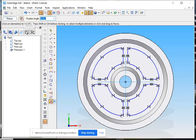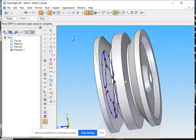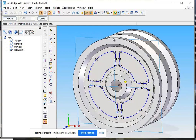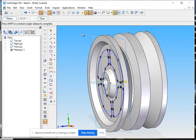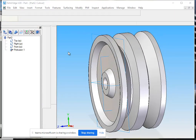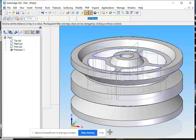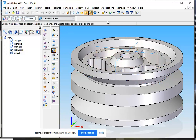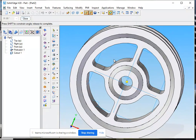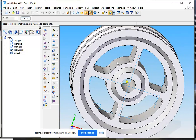I just want to revolve and see where I have drawn these sketches. You can see that these sketches are drawn on the face of the pulley, because we have taken this face as our sketching plane. Return. Now the cut is going through the pulley. Finish. Now we can see our blank of the pulley — we have created the ribs to reduce the unnecessary material.